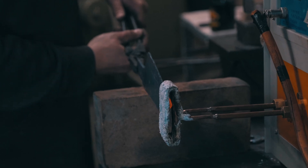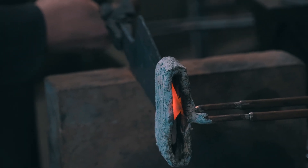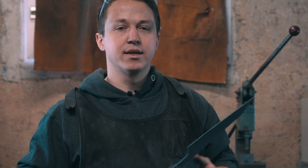You can't really compare it to normalizing in a gas forge because you can't hold the entire steel at the same temperature. So I just move through the coils very slowly, bringing increment by increment to the right temperature, and then let it air cool back down.